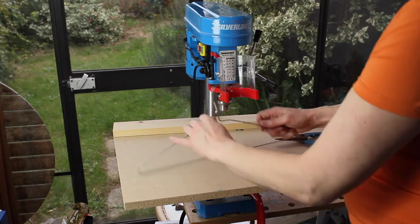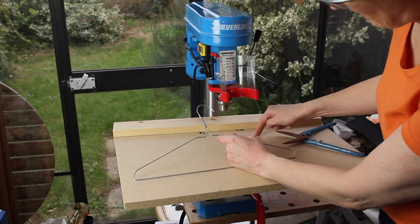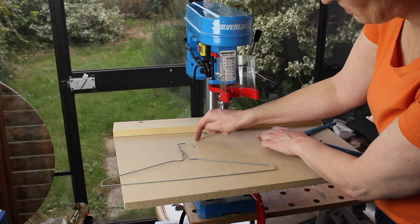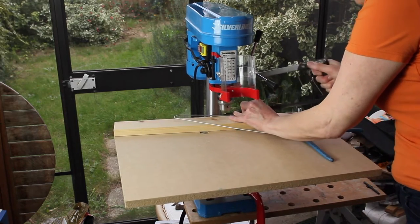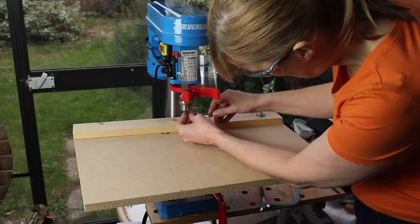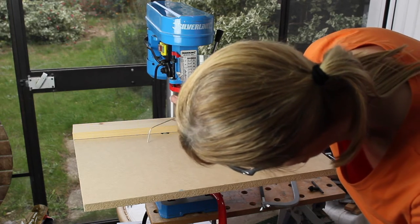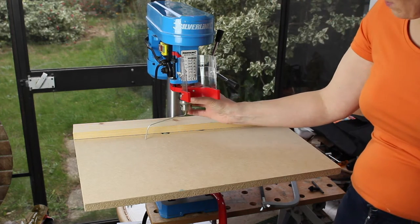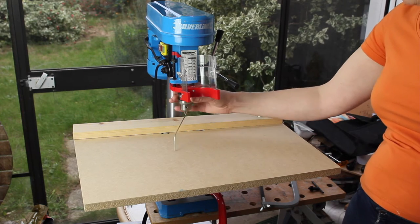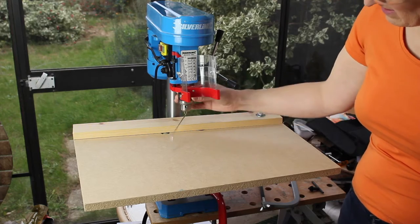So let's create a little tool — a coat hanger. The idea is I'm going to create a little wire section that sticks out, and if we can set the table so that the end of the wire is on the table here and then rotate it, it should still be on the table over there. One piece of bent coat hanger goes into the chuck. That's a whisker above the table on that side, and a whisker above the table on that side — so that is flat. I'm rather pleased with that. It's level that way as well. That way I've got no control over — it's down to how this is engineered. But it is nicely leveled.